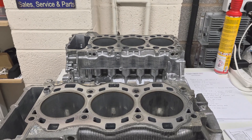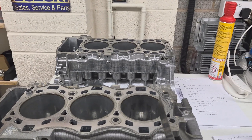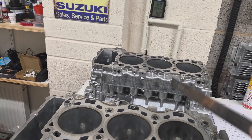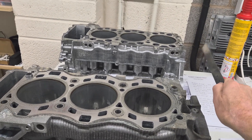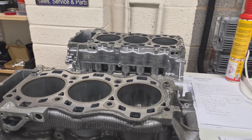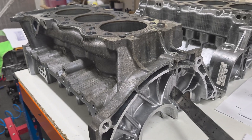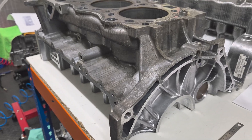Let's take a look at the design that Porsche have employed on this engine. There are two sets of three opposing pistons. You can see how they've offset them — so this block ends here and we've got this extra material here. Porsche have taken away some of this material and bridged it to strengthen it, however there's still a lot of extra material there.